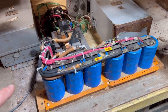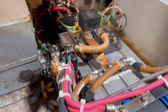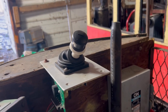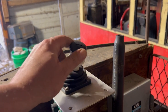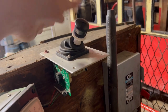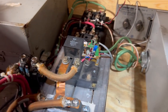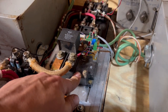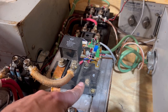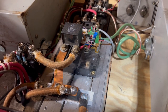The output of those caps goes to a contactor, which is this little guy right here. That contactor is closed by the activation of the throttle. In this particular car, I have just this little joystick-looking deal — it's got a lock on it, and you move it back and forth. It's got a little micro switch so that whenever it's first engaged, that switch closes and that closes this contactor. When that contactor is closed, it puts power to this Darlington power transistor module. Normally I use IGBTs, but I had a few of these laying around. I think this one's good for like 200 amps, and I decided to use it because this motor is pretty small and it's not going to draw a lot of power.